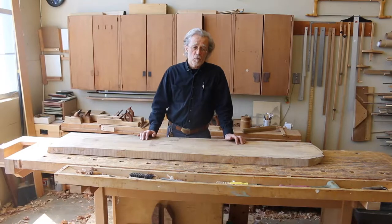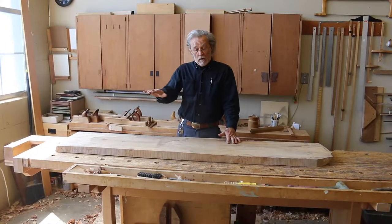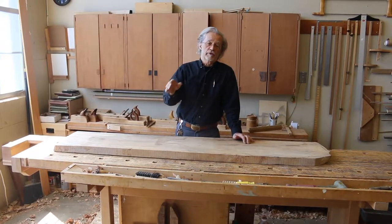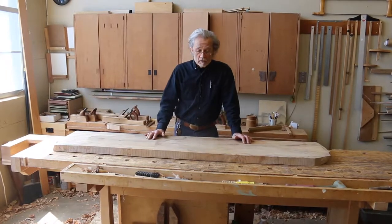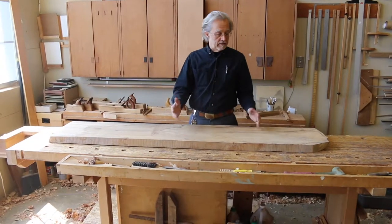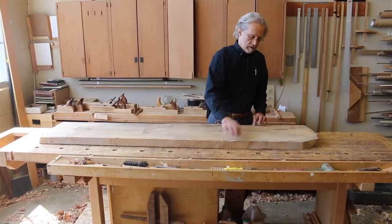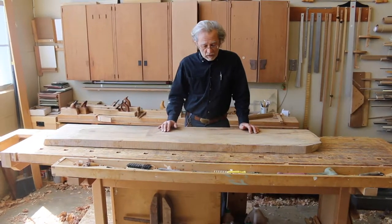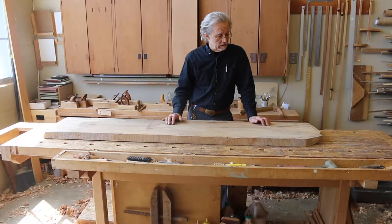You could say you're planing more off, but it's a very, very small amount more — only the amount of the curve. If you visualize it, you're taking a straight line across the crown; it's basically the same amount, the only difference being due to the slight curve on the board. If you're doing the whole board by hand, it doesn't make any difference because you're taking the same amount off regardless of which side you start. I also don't like working on the concave side, skipping across the narrow edges where I'm cutting a little bit here, no cut, cut on the far side — it seems like wasted effort. And you're always working at the edge, which increases your chances of spelching out the grain on the far side.